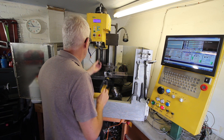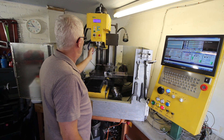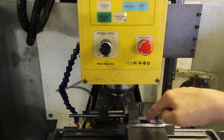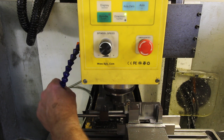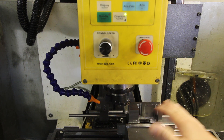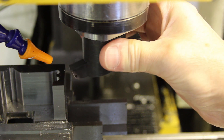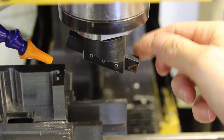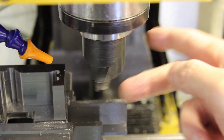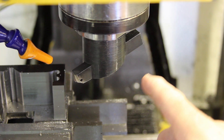It's the following day and it's time to change tool — we'll put this fly cutter in. To finish this now I only need to take the top off, turn it over and take the top hat off the other side. It's quite an easy job, so rather than doing a program I'll just type in the commands. I have checked we have enough clearance, so let's get on with this. I'm cutting this way because the load is forcing the work into the fixture on the vice, and the chips get thrown to the back of the machine, not over me.